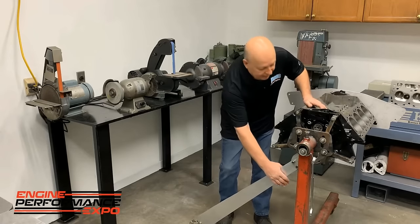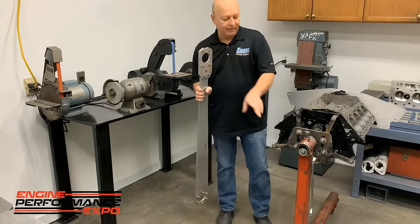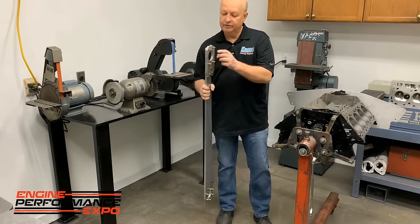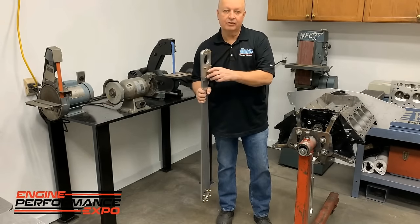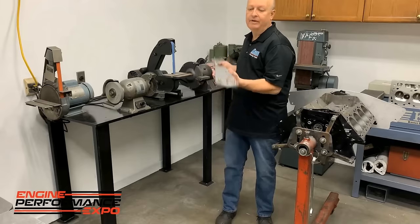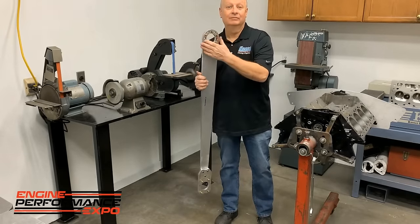So all it does, it just plugs in the back. The Ford has four pins because they have an uneven bolt pattern. These are turned down to about .350, so they'll slide in there, made out of brass, and they won't hurt the threads. And then the Chevy end, same thing, but since the Chevy is symmetrical, six.